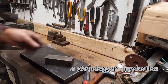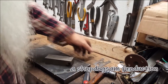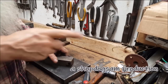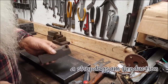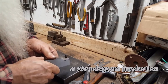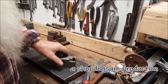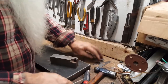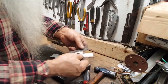This is what we got. This is what we need. One each. So, as you just seen on the bandsaw, this right here was in a box of scrap from a machine shop. I think that was probably a bit holder at one time, some kind of fixture. Just an odd piece of metal laid around. And the need was two shims, one with the long leg right there and one with a short.